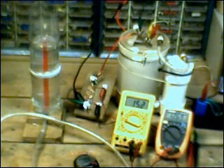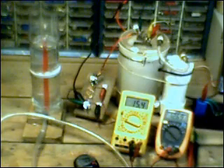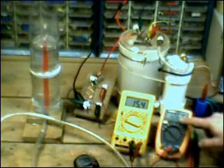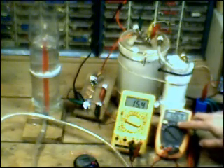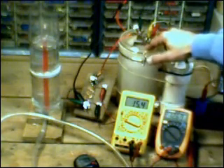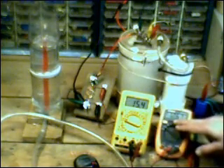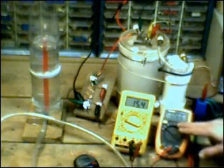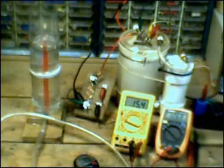I'll let go and it'll come right back up again to about 15.3, 15.4. So when I increase the current, I'm going to subtract about 0.4 to 0.5 of an amp on the reading to get the actual true reading. The voltage is now folding back — the power supply I have connected is only capable of 15 amps, and now that the cell is warmed up it wants to draw more than 15 amps at 13.8 volts, which is why the current has limited and the voltage is now falling back to 12.67 right now.